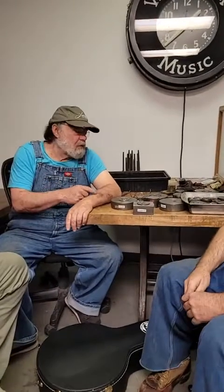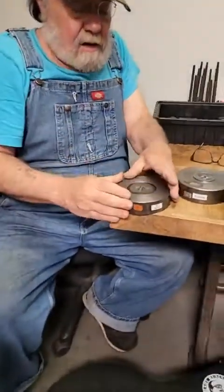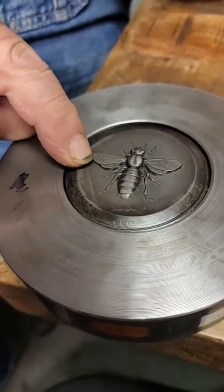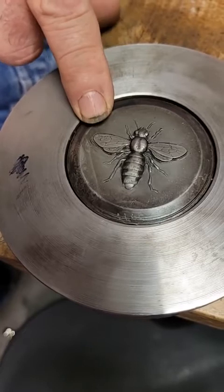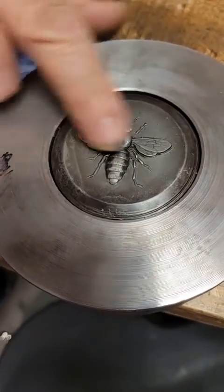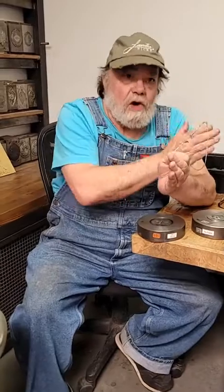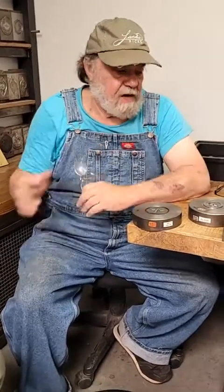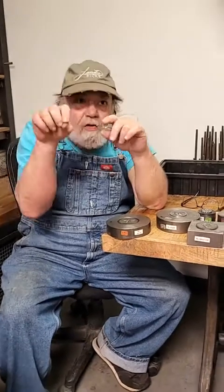I like to go back and forth — start in the negative, raise a positive, then touch it up. For example, this design has incuse lines on the wings. If you did that all in the negative you'd have to keep flat planes between each vein — nearly impossible. But by going back and forth, you get the general shape, raise a positive, then engrave the lines. On architecture especially, you can add layers for windows, window trim, and lettering.